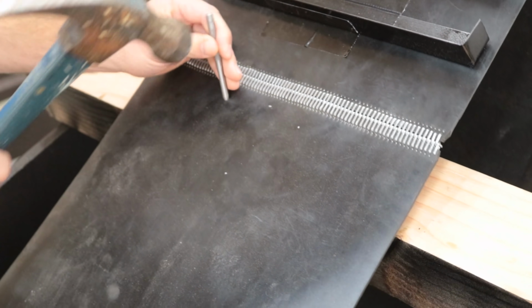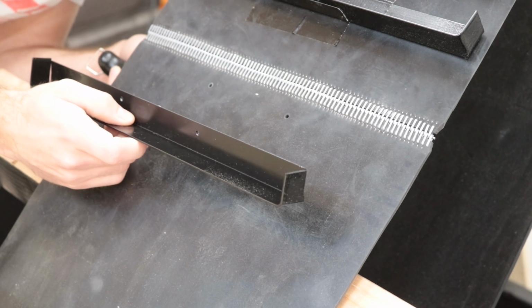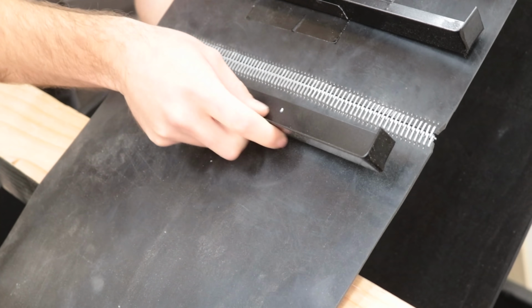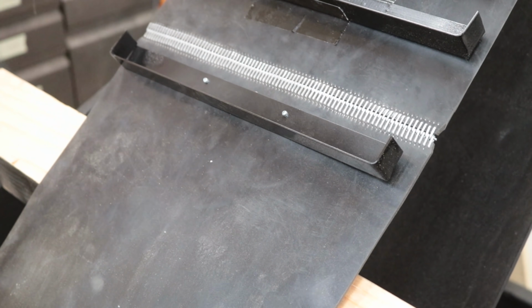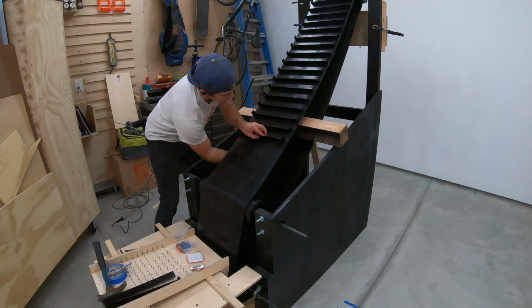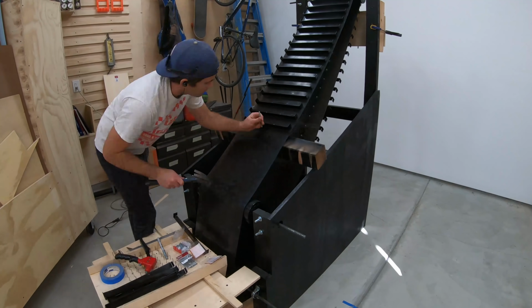With a wood block behind the belt, I hole punched 1/8 inch holes to match the size of the rivets. Each rivet gets a washer on the underside to spread out the pressure on the conveyor belt. Less chance of failure. When both rivets were tightened, that bracket was ready to go. There's a little bump on the bracket, but the underside is flat and will glide around the rollers without making a sound. Installing all the brackets was pretty exhausting.